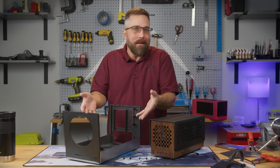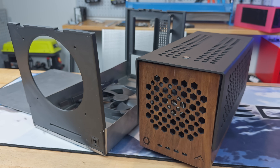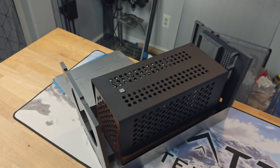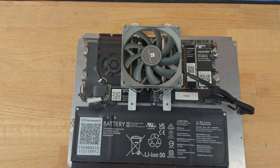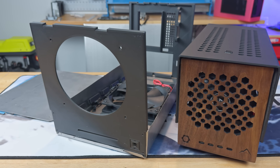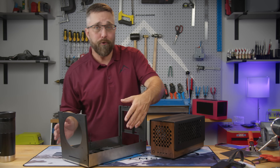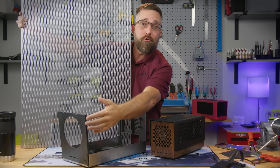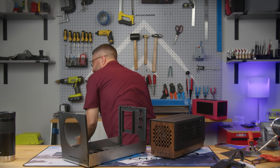Now, I know this is just a pile of parts, but in my mind when planning this video it was a finished product and this was going to be an awesome surprise reveal. This stack of components represents the beginnings of an identical but significantly larger enclosure. When it's finished, this case will accommodate full-size graphics cards, the mainboard with my cooler mod, the stock Framework battery, and a standard SFX power supply with a 140mm fan. I'll be building it in the same manner, except using glossy black acrylic for external panels, stainless steel mesh for the top cover which I'll polish to a nice shine, and a seamless intake grill inset into the acrylic panel. I'm doing this one right — I'll laser cut the acrylic after I finish the metalwork and fabricate the top cover last.